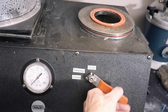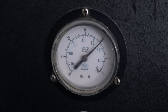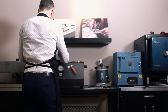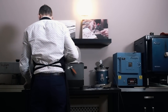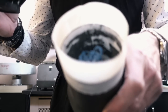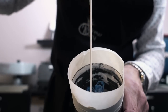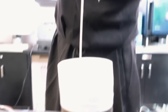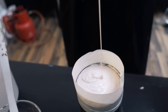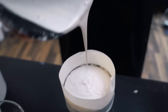We tap the base just to help the bubbles come up. Let's pour this — pour it down from the side so we don't damage the waxes — and that will go right to the top of the flask. It's starting to thicken quite a bit now so I'm going to rush and get that back into the vacuum chamber.